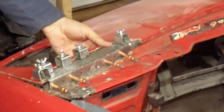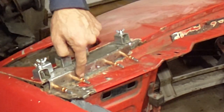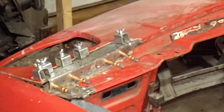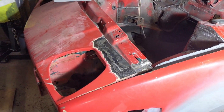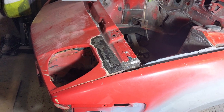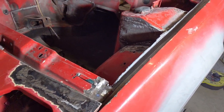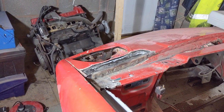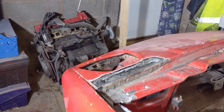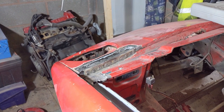So this is my patch. I'm doing a butt weld because I decided I couldn't get underneath here properly to do it. So we'll butt weld across here, spot welding — take these out and spot weld in there. I was last out on Monday, today's Friday. I had my booster shot Monday afternoon and it just really knocked me out, so that's why I haven't been out. We've now ground this bit down — it's not too bad. I just did a butt weld in the end and decided it was the right way to go. Spot welded or plug welded — just need to fill in a couple of these a bit better. We'll get some paint on there to protect it and move down the line.